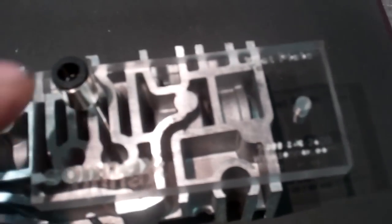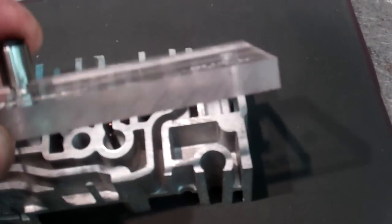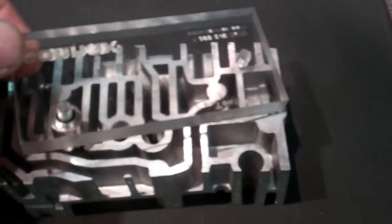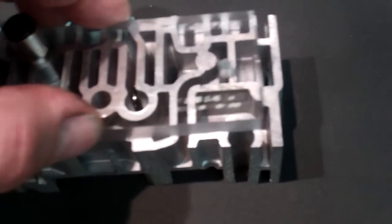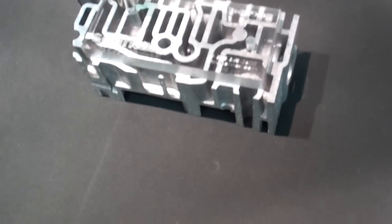Also, here's the test plate. It has a cool release valve. You press down on this plastic here, and you pull out the tube. Very nicely done. And Bob T recommends, he knows a lot more about this than I do, and he filled me in on some of the tips. Just coat the backside with trans gel, so when you place it onto the valve body, it helps promote the suction to the valve body, which better suction means less leaks, more accurate readings.